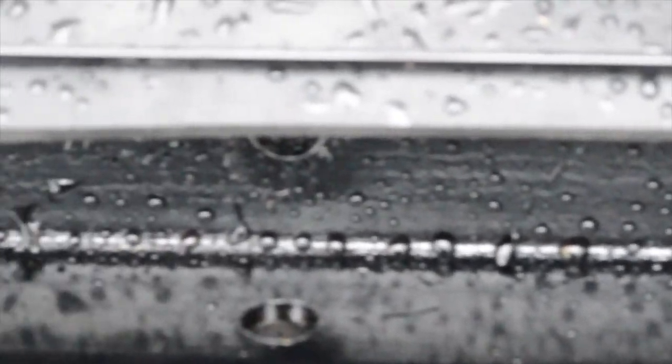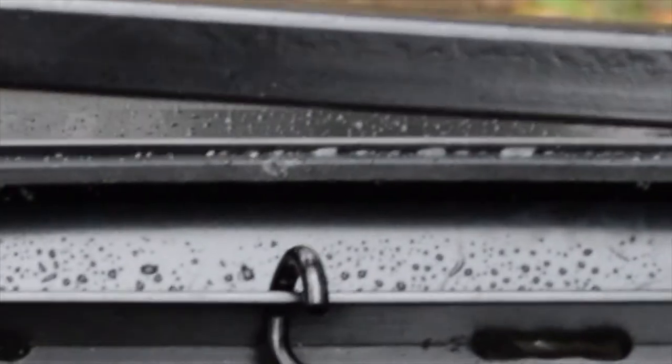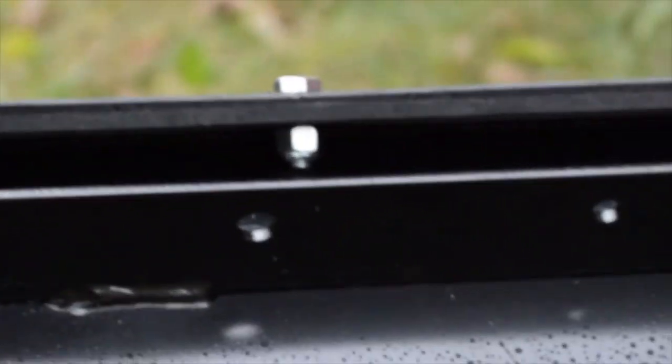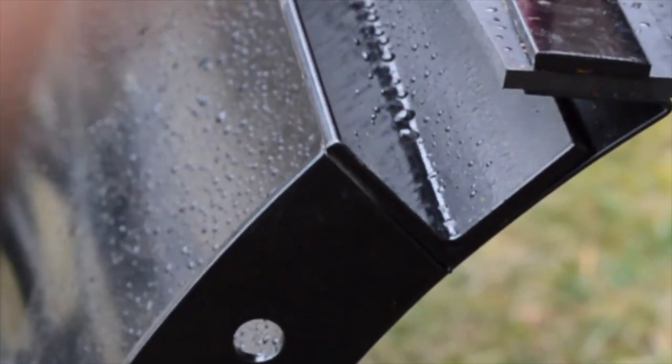So you look down here and you realize that this top bar has been drilled through on two angles for the breakover springs, or trip springs. It is a trip blade. But if you notice on this one, those holes are not at the same spot they are on the other side. So one of the top bars, which by the way is a single piece if you look at it from this end, that angle right there is a single piece. And this one is welded once, but on the wrong side.